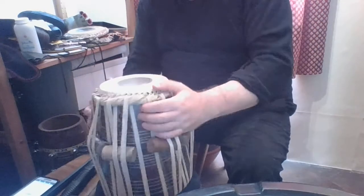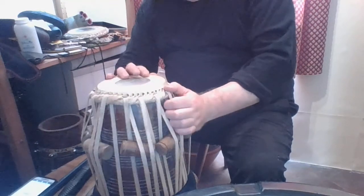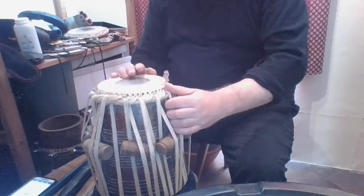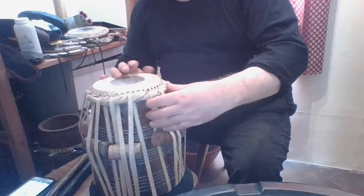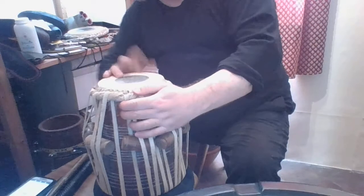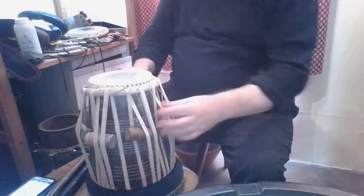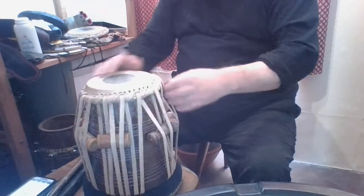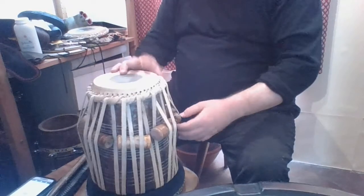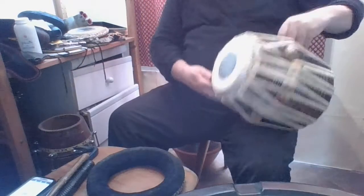So we'll assess the whole drum now. The first one went on really tight. Second one went on, not as much movement. So that's good. So we'll just assess what's going on the rest of the drum now. It'll make a big difference everywhere else. So the bits that were still on 2 straps have actually gone higher. So that's a good sign, because it means the tension's getting distributed.